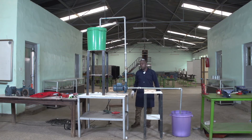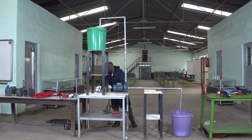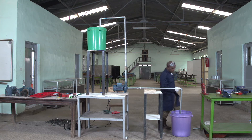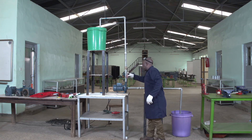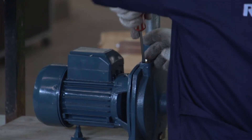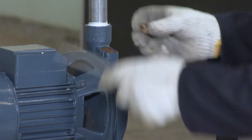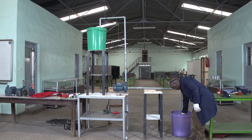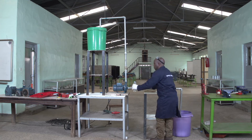Then I am having my pump on the suction side. Before starting the electricity, I am going to do what is called priming. This priming is to fill the water into this side of the pump. I have to open the pump — I remove the cap. After removing, I have to use a bottle to fill the water inside. So I have to take the water here.